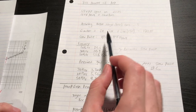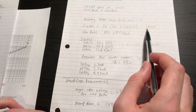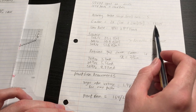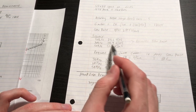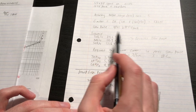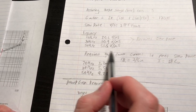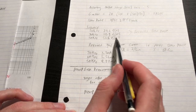We also need a driver that can drive the Miller capacitance. With our two 845s, the Miller capacitance is approximately 180 picofarads plus whatever additional wiring capacitance exists. That capacitance and our large voltage swing requirement impose a slew rate requirement that must be met to avoid slew-limiting distortion. From there we can figure out the current requirements to meet minimum slew rate.